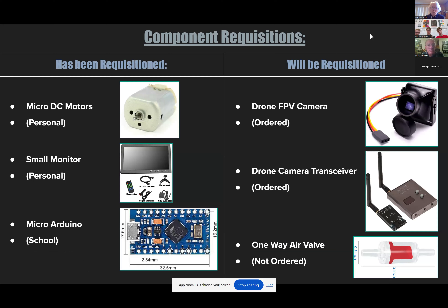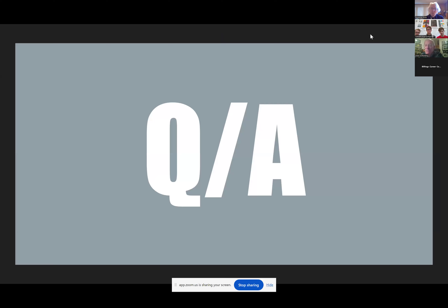The piston injection system uses a single-use canister of air with a control mechanism. It releases into two chambers that propel two pistons forward, launching the robot outside the container and onto the lunar regolith. We've been developing our electronic system simultaneously with our designs, with the exception of the video system which just arrived and the air valve which we're currently debating.